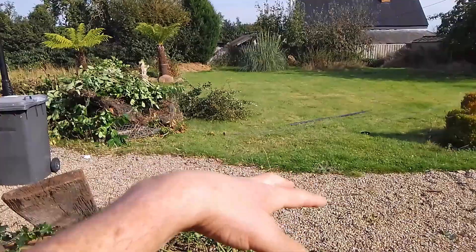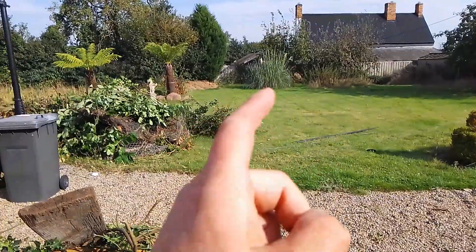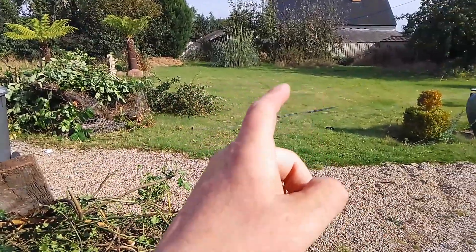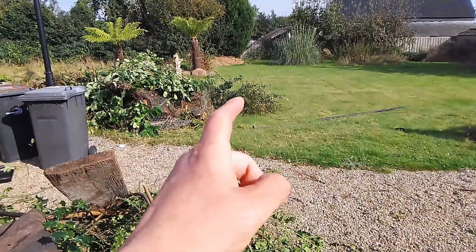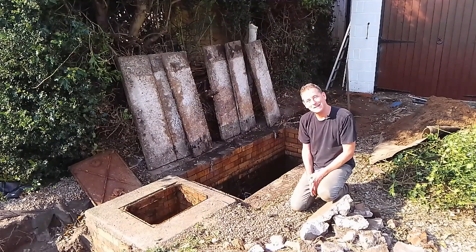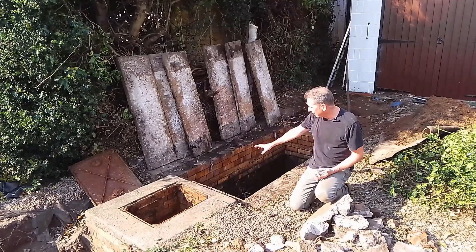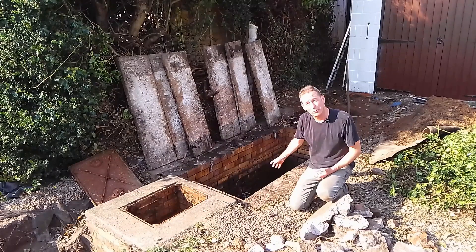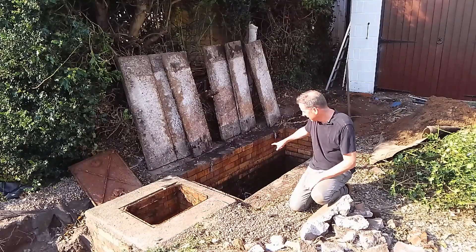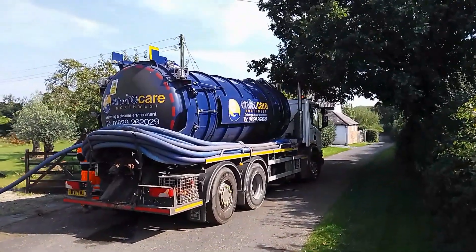To try and find out where your soak away is, just walk around your grass and see if there's any damp patches, or observe where the grass grows particularly well — that's likely where your soak away is. So you can see there's no great mystery to it: flush the toilet, waste comes down, sits in the chamber, gets worked on by bacteria, effectively turns into gas, water and sediment.